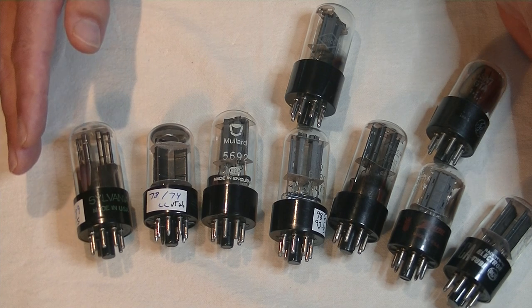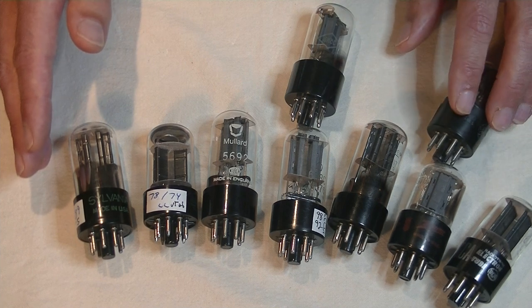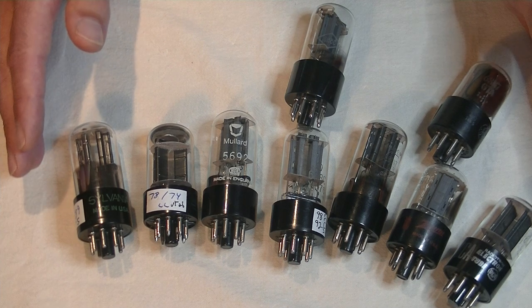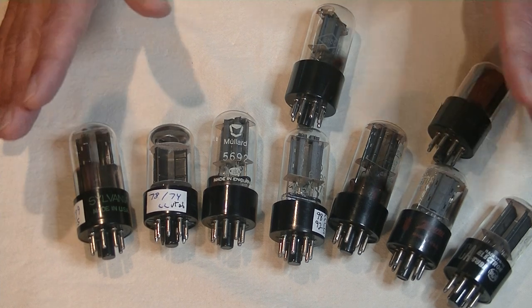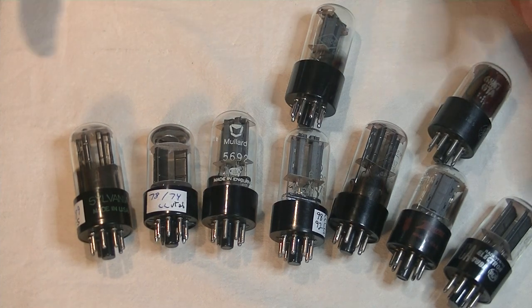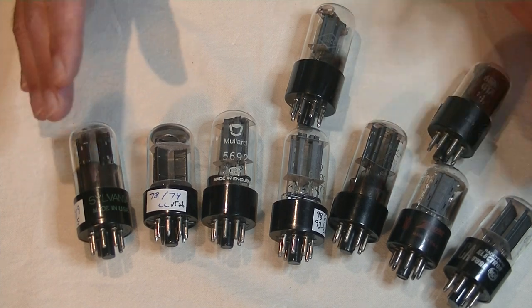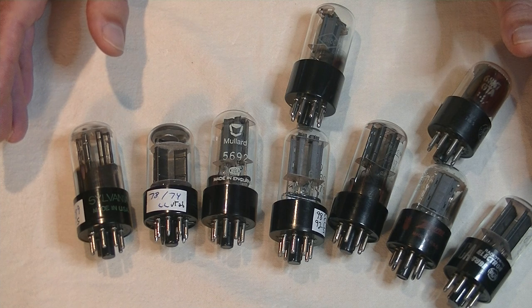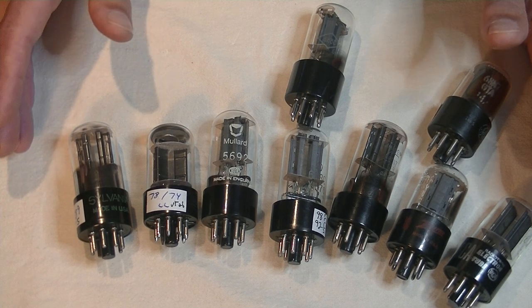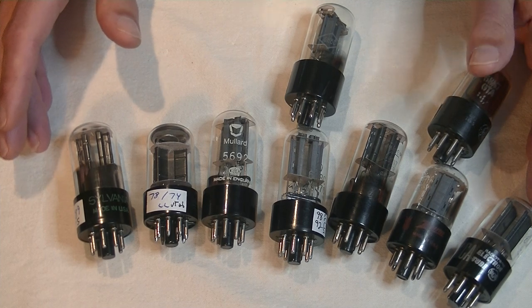The third generation was the GTB, with the same voltage and wattage as the GTA. Here's the GTB right up here. The main difference is in the heater specification, and nothing for us to worry about. So why is this important? If you want to use a vintage 6SN7 GT, with its lower maximum plate voltage and lower wattage rating in a modern circuit designed for the GTA or B, you may exceed its maximum ratings, and bad things may happen quickly.